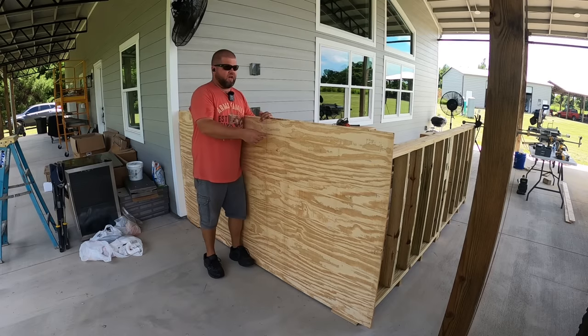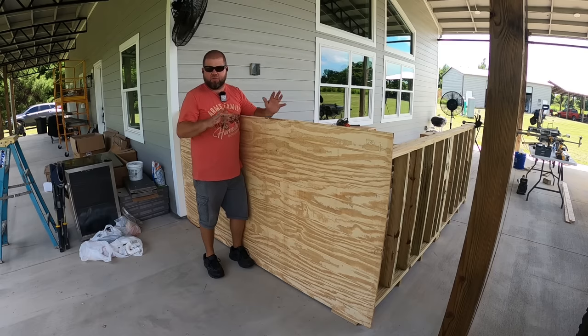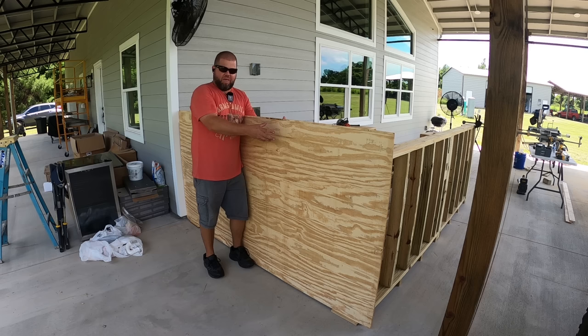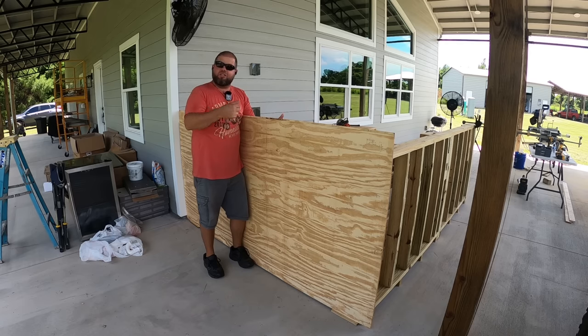We decided to go with a grooved panel — this is called four-inch on-center paneling. The reason we went with this is because it kind of mimics the look of the house, but not exactly. We considered doing Hardie on this, but carrying it out here looking just like the house felt like it was going to stand out and not look quite right — we wanted it to be similar but a little different. We're also going with non-pressure-treated paneling because nobody makes grooved pressure-treated paneling. I'm also highly concerned about pressure-treated plywood and paneling — it tends to dry, warp, delaminate, and just kind of do whatever it wants. Once we get a good coat or two of paint on this I'm not concerned at all. All the wood out here on the porch is non-pressure-treated as well — as long as you paint it, it's good.